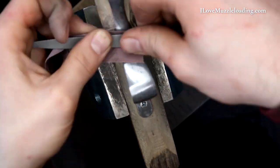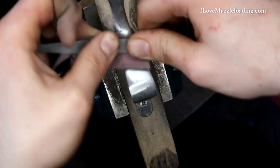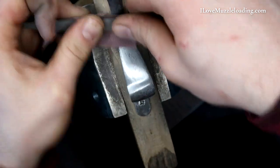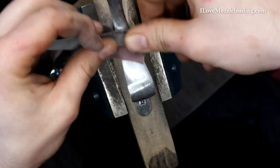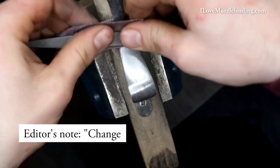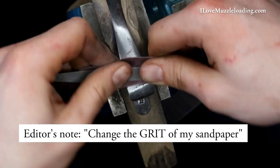When you're doing this, it's going to be tempting to just work in one spot. But what I like to do is go around and get the whole piece sanded to a particular degree, and only then is when I'll change my sandpaper. That way I don't have to worry about missing or going through an area the wrong way.